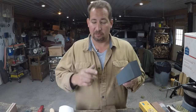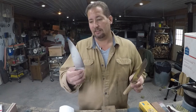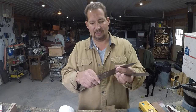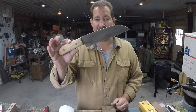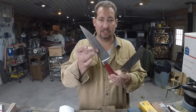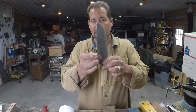Thinning a knife, to me, falls under an advanced to medium-advanced sharpening technique, and something that is well within the realm of what's possible at home with a normal sharpening stone or maybe a slightly oversized one. I've got two different knives here: a Faberware Walmart special with a very light convex grind or maybe just a poor flat grind, and one of my very first kitchen knives in 1095 steel. That way we've got two different classes of knife - a really soft stainless steel knife and a differentially hardened 60-62 Rockwell 1095.